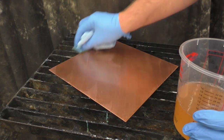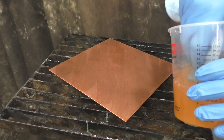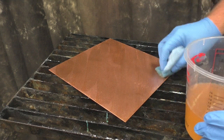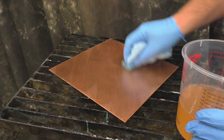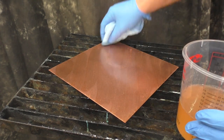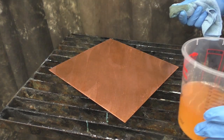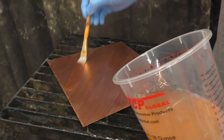I'm trying to get an interesting look rather than our normal either splotchy or overall finish appearance. I'm going to need to do a couple of coats because it is coming in so thin — that's not abnormal when we do the patina gel with the torch, it does slow the reaction — but I've decided that I wanted to switch to a brush.